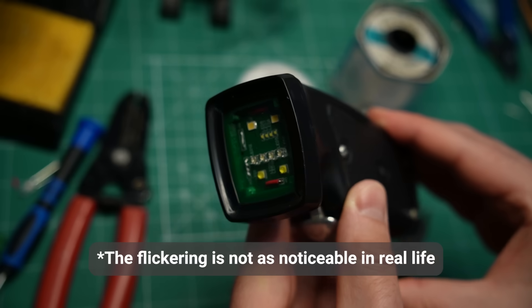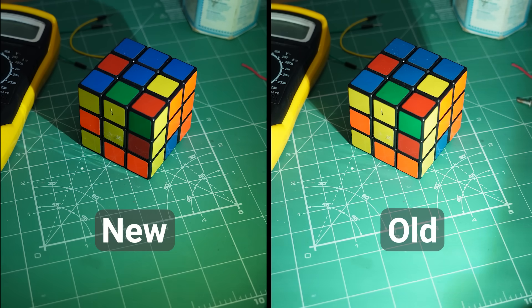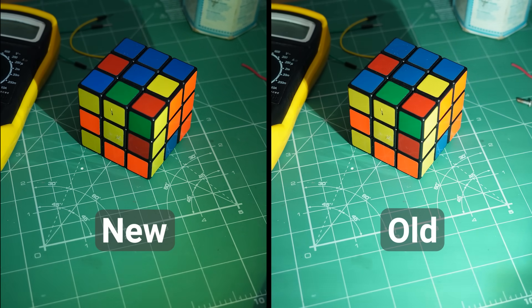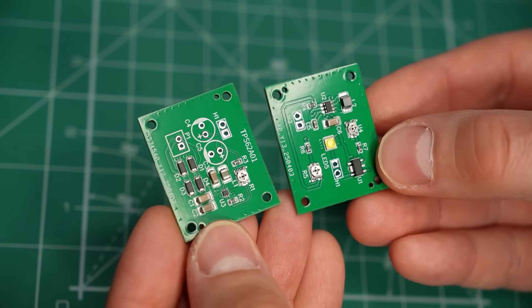But was it all worth it? Well, on the one hand, putting this circuit together was a nice challenge and exercise — it is very satisfying when you build something this complex and it works. On the other hand, I still prefer the simple approach with a pair of diodes from my previous video: I get light instantly and it's much brighter because all of the energy goes directly to the LEDs. Also, I found a problem with my design — the voltage from the flashlight turned out to be too high for the buck converter. It gets overloaded after some time and stops working. That is why it is a good idea to build prototypes in separate modules for easier troubleshooting. As always, leave your questions in the comments below and I'll see you in the next video.